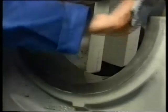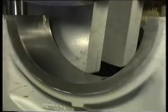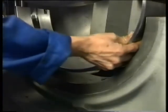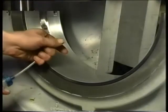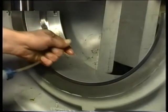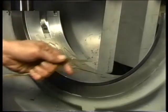Remove the turning plate and clean the main bearing cap well. Now place the lower bearing shell in the main bearing cap and make sure that the backside is clean and dry. Make sure that the bearing positioning lip falls into the main bearing cap recess. The lower bearing can then be fitted in one position only. Equalise the bearing joint faces with the joint faces of the main bearing cap and apply a layer of clean engine oil to the running face of the lower shell.